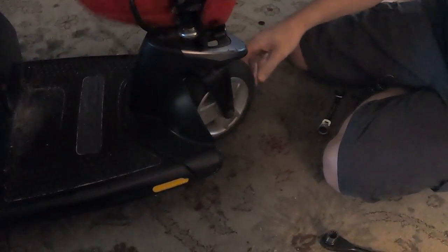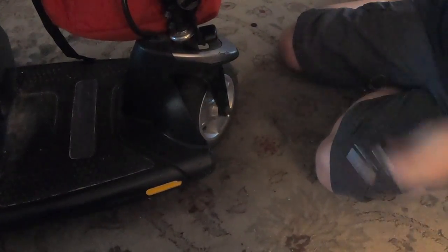This is on pretty tight. I didn't crank it down like crazy, but it's on there. That's our little repair — didn't really take a whole lot of time at all. Cost about 20 bucks, which amounts to four bucks per wheel — about the same price as Monster Scooter Parts. I suspect these skateboard bearings are actually better because skateboarders care, whereas scooter manufacturers buy parts in bulk as cheaply as possible. I probably upgraded the bearings a little bit. Bearings are bearings. Now I've got six more in case these things blow out again. This is what you do if you find that your bearings are blowing on your scooter — it probably works for every scooter.